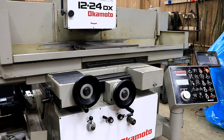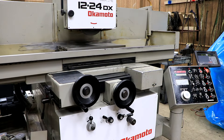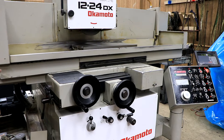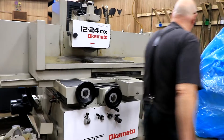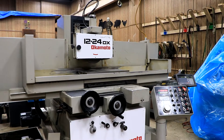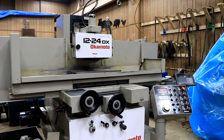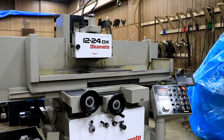It's a nice machine — this is the original paint. These covers are really nice, and the dresser looks really nice too. So now we're reversing the saddle because we got to the stop over here. Now we fed down one thousandths; we've got a thousandths left to go, and then it's going to do a number of empty spark out passes.